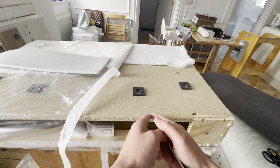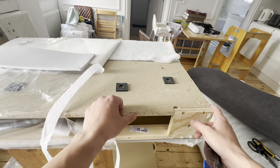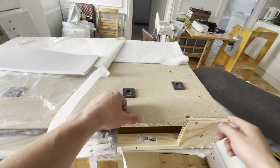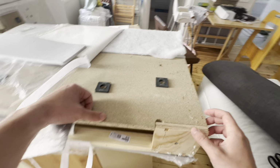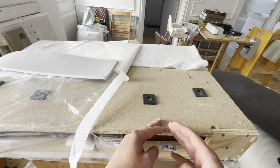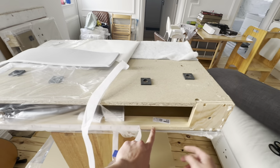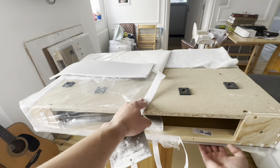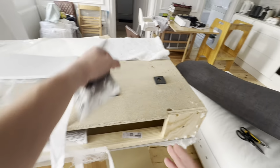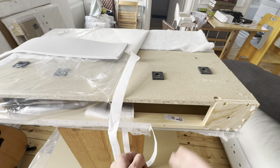I'll work out at 66 what's left here, because it's more accurate to use a shorter distance to run off. Just set the mark at whatever this may be, 20, something like that, and then do a couple of reference points at the bottom there, and then with a ruler, strike a line to get it straight. Run off this corner up to the point, flip the arm over once we've peeled the backing off, do the same again at a few different intervals, strike a straight line, and then we'll be able to cut it.